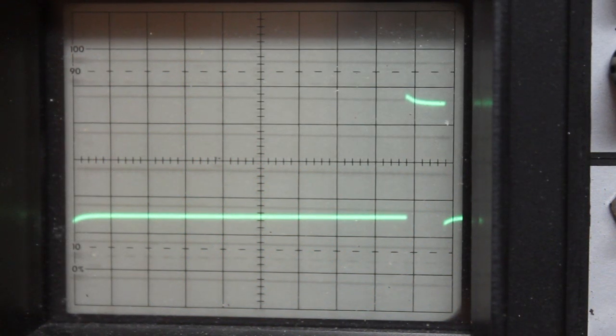This is a 5 kHz signal where the positive side of the pulse represents the motor on. The longer that pulse is high, the more power that's being applied to the motor.